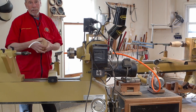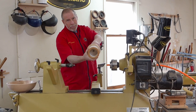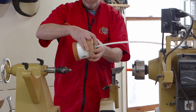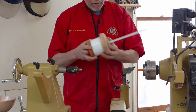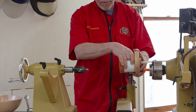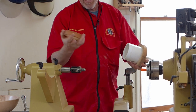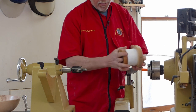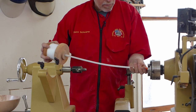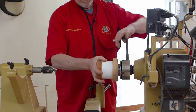You can buy chucks direct from him, or you can make them yourself. And what he has is a bearing that's held in the center and the bottom. And I lathe turned this disc with a tenon, had it in the chuck, cut a groove. I put in PVC pipe, and I buy these collars from Rubber Chucky. Sorry, and they make these in different sizes and a bunch of other projects. So this hose fits inside the vacuum hose. It's easy to put on in a hurry because all you have to do is tighten it back up in your tenon.